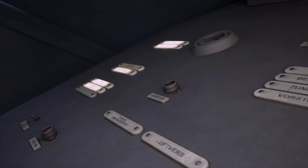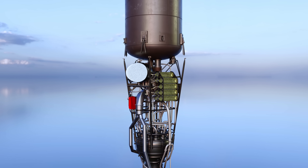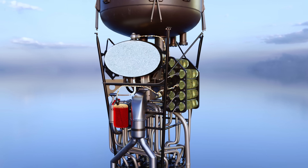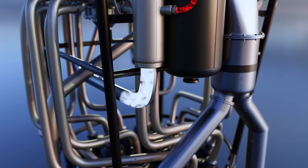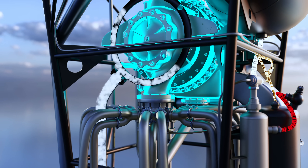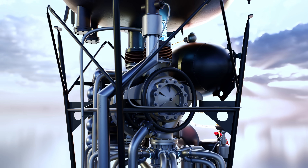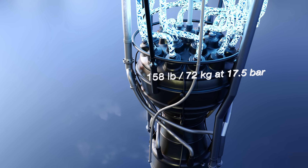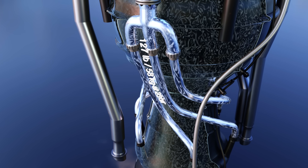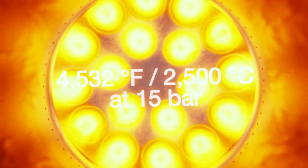The troop commander would order everyone to clear the site before entering the command vehicle to give the order to begin the launching procedure. Inside the rocket, the pressurized nitrogen forced the hydrogen peroxide and sodium permanganate into a steam generator, causing the two mixtures to react and produce high-pressure steam. That steam powered the turbine inside the turbopump to spin at 3,800 rpm, pumping 158 pounds of liquid oxygen at 17.5 bars and 127 pounds of fuel at 23 bars into the combustion chamber each second.